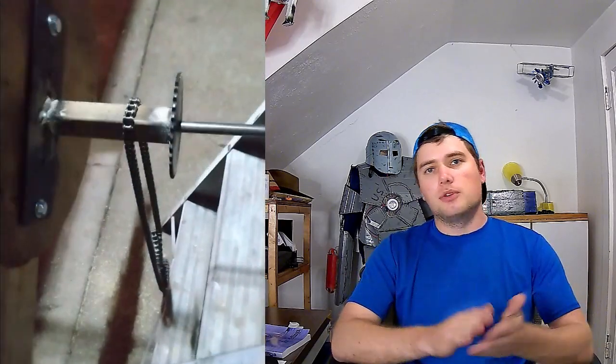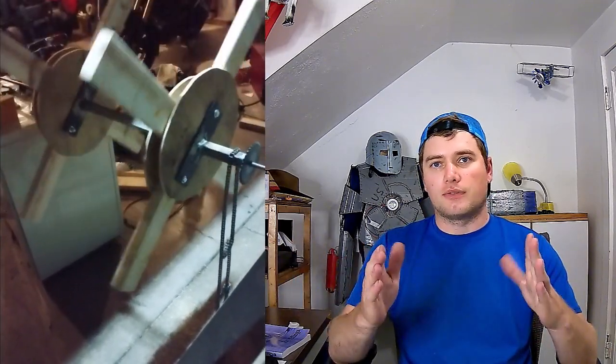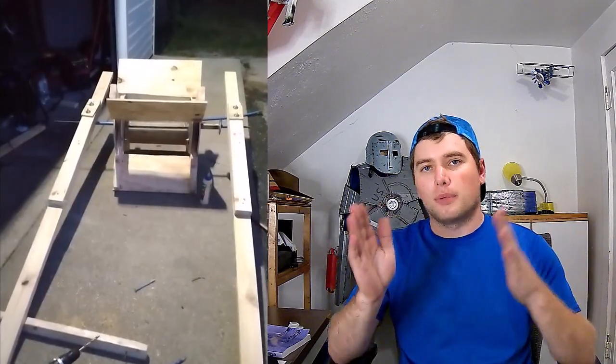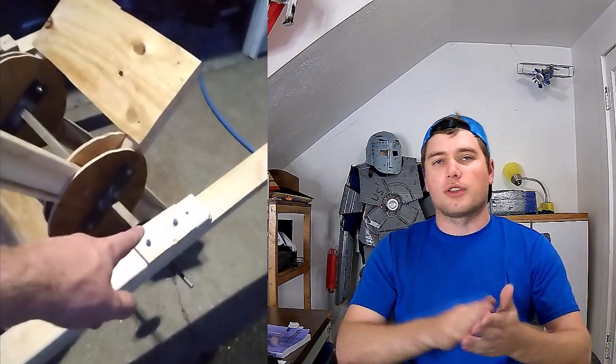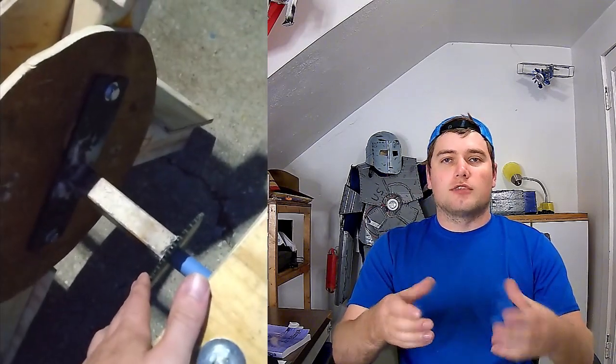If you look at the right side, you'll notice we've got the gear mounted to it. I'm using a 35 chain — I do not recommend a 35 chain; it just wasn't strong enough. A 41 or 420 chain would have been better, which we later swapped to. You can see the big metal shaft built from the 1x1s, welded everything together, and now I'm building the actual paddle wheel holder. The two arms come off the back of the boat — I'm using 2x4s layered together and glued, rather than buying 4x4s, because 4x4s are more expensive.